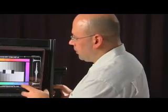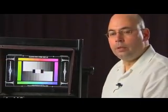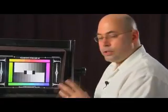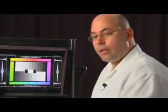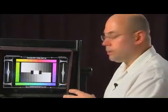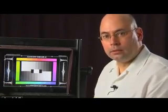Now the optical signal generator will produce a very definite pattern on a vector scope, and these steps will also show a very definite pattern on a waveform monitor. So that's why DSC Labs calls these OSGs, or optical signal generators, because you can use a Combi like this, and they're extremely color accurate. Having spent an afternoon at DSC Labs, I know certainly David Corley and the staff there take this very, very seriously. So a white is a white, a yellow is a yellow, and the colors are quite accurate, to the point where they will generate a pattern on the vector scope that will allow you to basically color tune the camera for, I guess you could call it, accurate color reproduction.